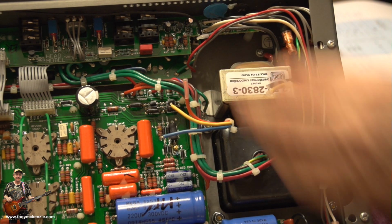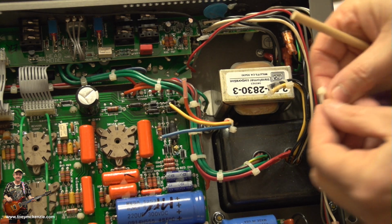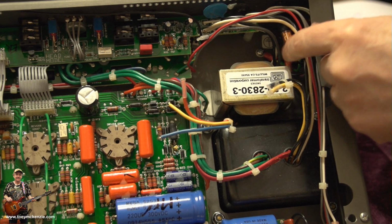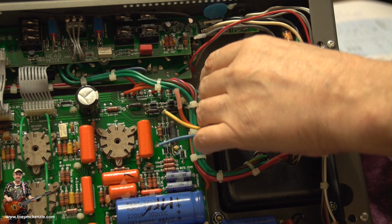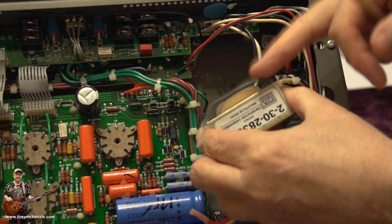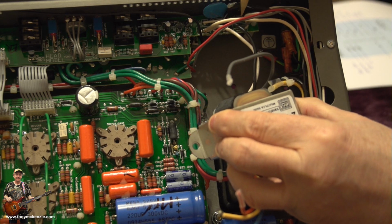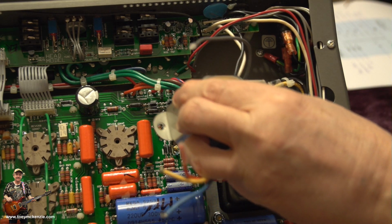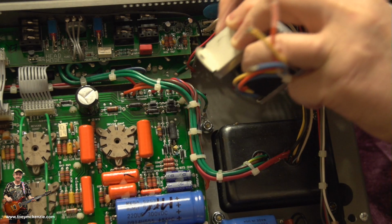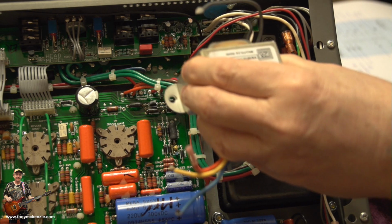And the other wires, I've undone the sort of little clips that come on this thing. You've seen them. I've undone all of them. And what you're left with is a couple of wires that you can sort of follow in. The grey isn't connected to anything, and the black and white, you can see where they go with all the others. They go with the ones on the power amp too. Fancy that. So we can just change those 2 out, flip this out of the way, put the new one in its place, and we're getting into business.